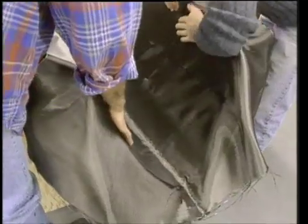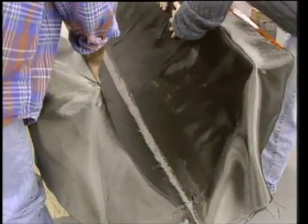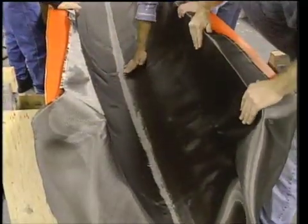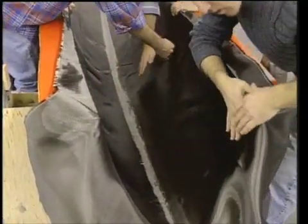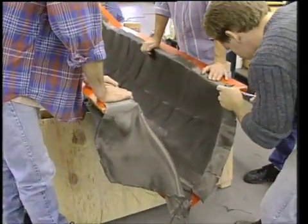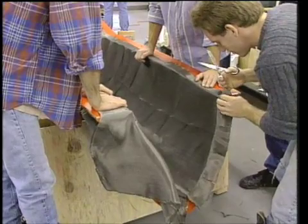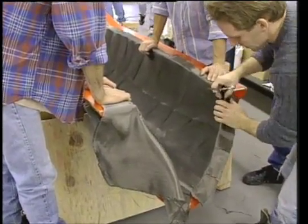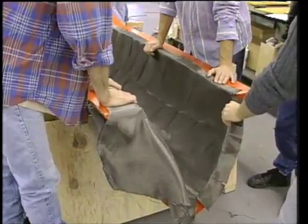There are times, however, that fabric will lay into areas that paper will not. If you only have a slight crease or overlap in your paper template, you would want to attempt to lay in your fabric before resorting to relief cuts. The template can then be laid on the fabric at the appropriate angle and cut with scissors. Final trimming is usually done in the mold to ensure a perfect fit before any relief cuts are made. Relief cuts are made only when a perfect fit is absolutely certain.